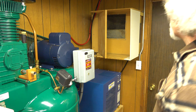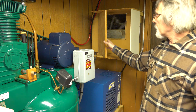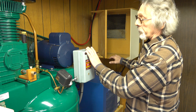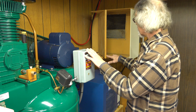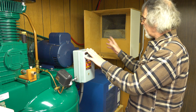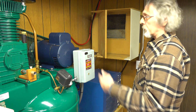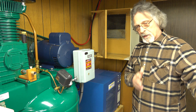Now here's the other side of the wall. Obviously, this is the side the air comes out on. And I have a diverter in here so that it shoots through this room and around the corner. If I'm working the air compressor really hard — like let's say the media blaster is going to be going for quite some time — that'll really warm this baby up. So at that point, I will open this deflector just to keep this a little cooler. And then I make sure I'll shut it down, because I've heard bad things about putting air on compressors — they don't boil off their own condensate then. So it comes up through this side, highly pressurized, and exits this way.